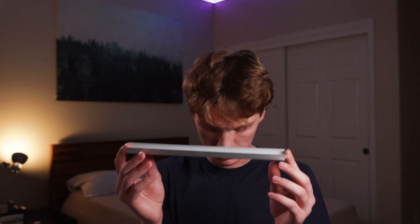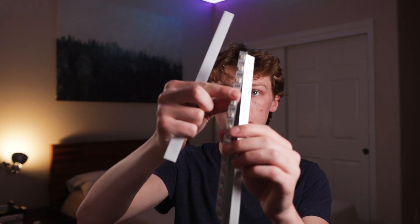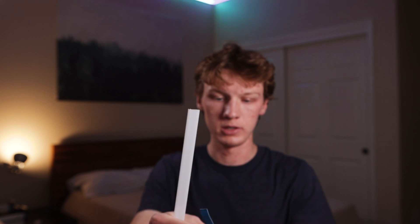Once they were all working, I started putting them in this LED diffusion channel. I have a little bit left over so I can show you how this works. This channel is a little aluminum extrusion with a milky white covering that goes over it to help diffuse the LEDs. I peeled the double-stick off the back of the LEDs, stuck them in here, and put the diffusion cover over it. That helps give it more of a linear glow — you don't see all the little dots as much, and it's more of just a glow that fills the room and makes the light a little less harsh.